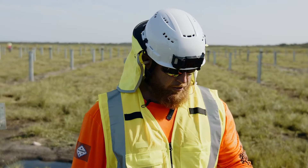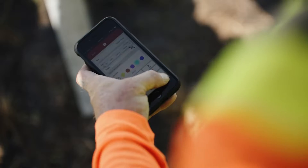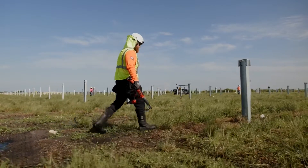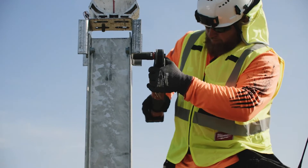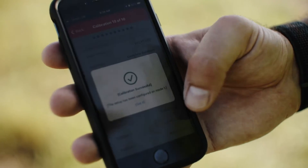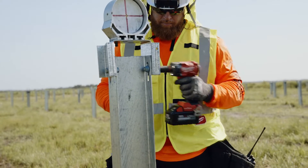We're in the field — we're going to click on the One Key app and set the torque value to 97. We test the tool first 10 times with a digital calibrated tool, put that data in, and then it can meet the torque value. We don't have to worry about over-torquing because it has that auto-stop function.